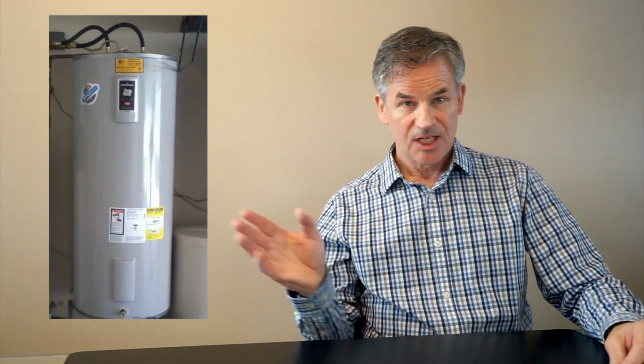Now, one other thing about water tanks is I see it fairly commonly in newer townhouse style condos that they are using electric water tanks. Don't do that. That's crazy. As we know, the BTUs on electricity are far more expensive. It's about 4 or 5 times more expensive per BTU to get your electricity than your gas. So they're very inefficient, although at the tank it's 100% efficiency, except your radiant loss. If you have an electric water tank, talk to the builder and say, what the heck are you thinking? Or if you have one, get it out and get a power vented water tank.